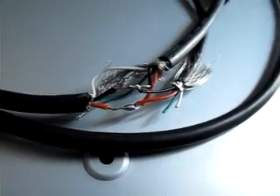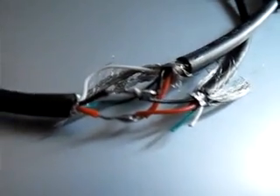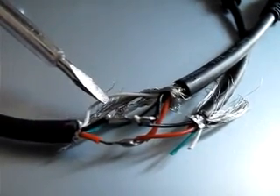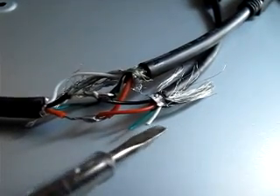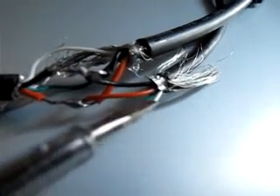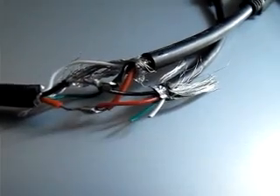This is also going to take a little bit of soldering. It is simply two USB cables. The thick one — this one right here — that's my main cable. Then I took another one, one of those micro USB cables, and cut it. Then I opened up the main cable and de-insulated all the cables. You have to leave white and green down here intact. On the small new little cable, you have to cut the green and the white, and then pull the insulation over the end of those cables so they are insulated — because these are the data cables and you don't want any of the data accidentally going into power or the ground.